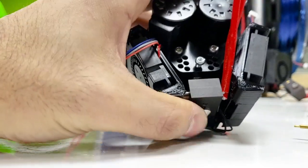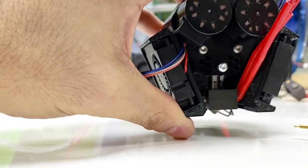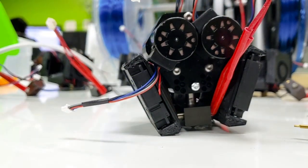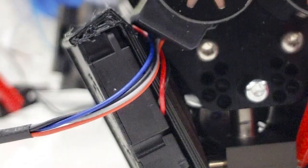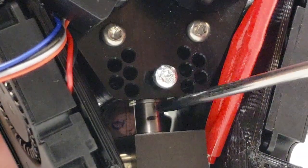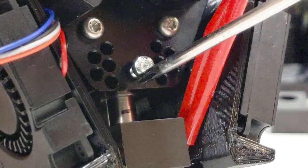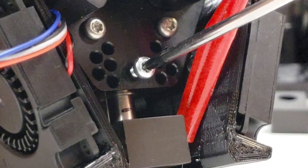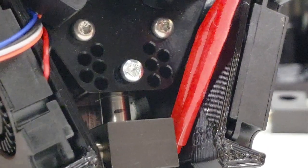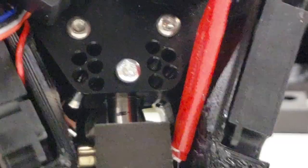You can also wiggle this in what would be the Y direction of your printer to get it in. Once it's in, the most important thing is to realize there is a metal ledge in here — you want to see that metal ledge go all the way up. When you're done screwing this in, you should see the screw push this whole assembly up. As I'm tightening it, see how it's getting sucked up? That means the PTFE liner has been pushed up, everything's aligned, and you won't get any loading issues.